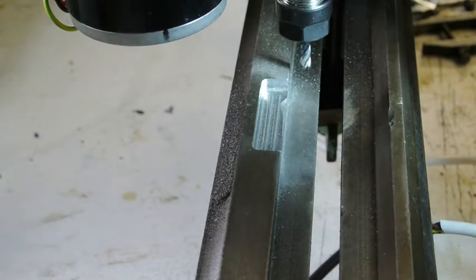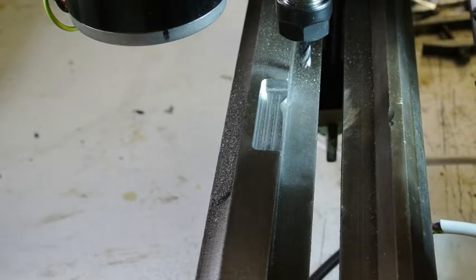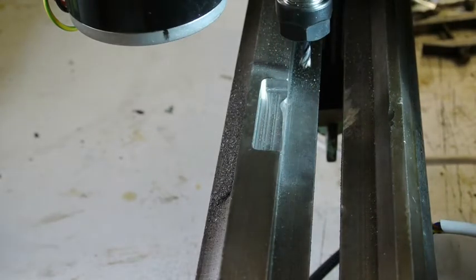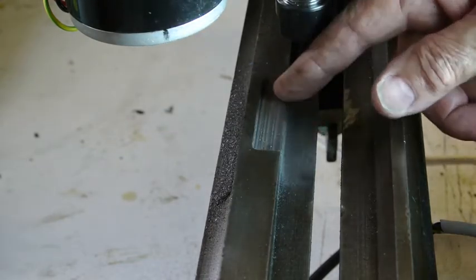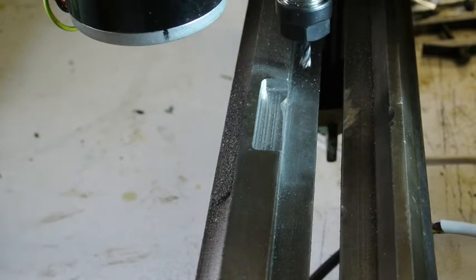So I've now gone down 6mm and I think I'm going to call it a day at that. It's getting a little bit difficult to machine — if I catch the edge here it tends to spin this lot around because it's only secured on one bolt. And I think I'll just repair this little bit here which won't be seen once the plate's on top there. It'll be JB Weld which I'm sure will hide that.